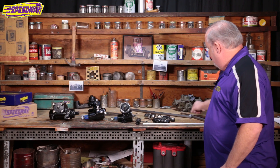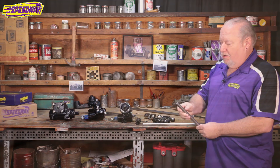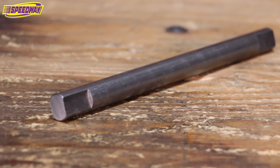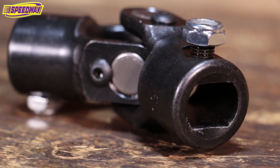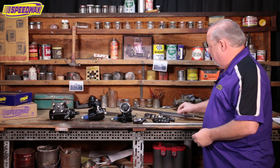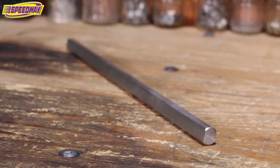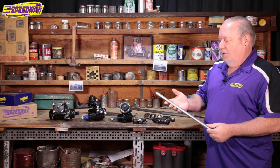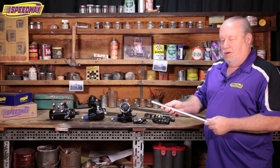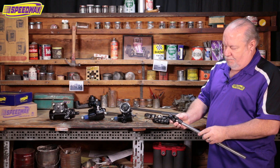I also brought kind of a combination one here. This has the smoothness of the round shaft, but it has the double D on the end, where you would use a U-joint like this — the double D slides on and there's a little set screw that holds it tight. We have two versions of complete double Ds: a plain steel one where the double D is milled all the way down the full length, which is nice if you need an odd length since you can cut it to whatever length you need. Like the other one, it uses that same double D U-joint.